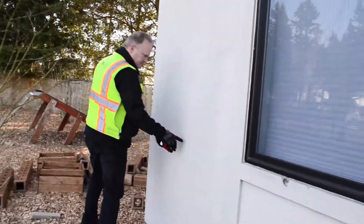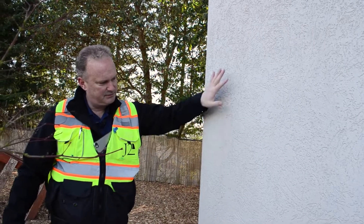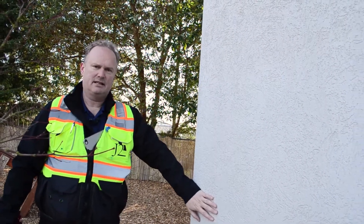Here are some brown stucco stains — an indication of steel lath that's coming through or placed a little too close to the edge of the stucco system. Pressure wash and coat or paint it, and that'll go away.